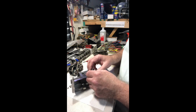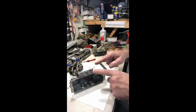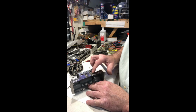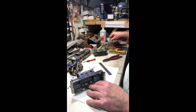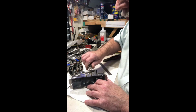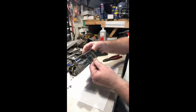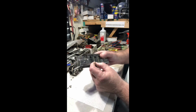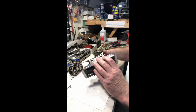These work on the notion that it's a shape like a letter Y. You slip it down into the metal shell and solder it, and once you get the railing in there a little bit, you take that Y and squeeze it a little, just enough to put tension on that new railing. You don't want them falling out, but you don't want to squeeze so hard that you smash it over. So again, that only took a few seconds.